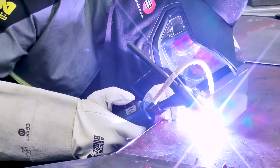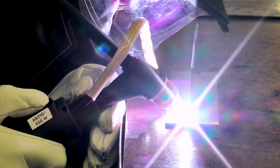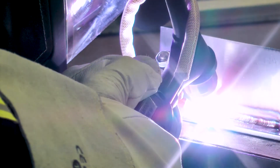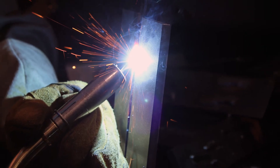Aluminum can be welded using different processes, namely TIG, MIG, and plasma. TIG welding is used mostly for thinner sheets of aluminum — for example, if you want to connect two 2-millimeter sheets of aluminum, a TIG torch would be fine to use because the proper amount of penetration can still be achieved. With thicker sheets of aluminum, we recommend using a MIG process because these torches can be used to achieve a higher melting rate through the wire.